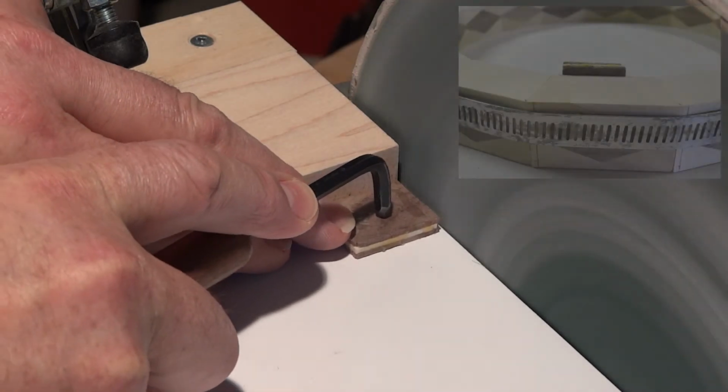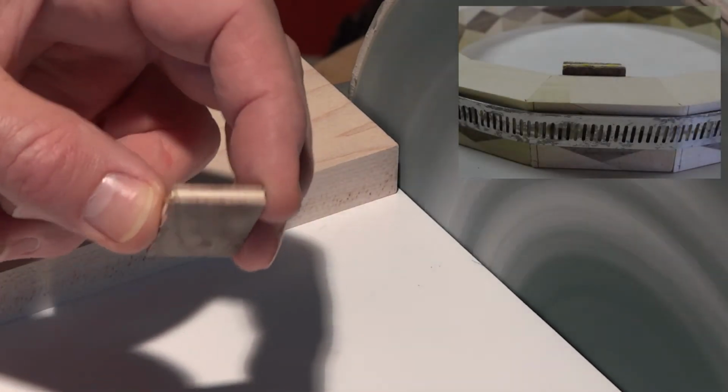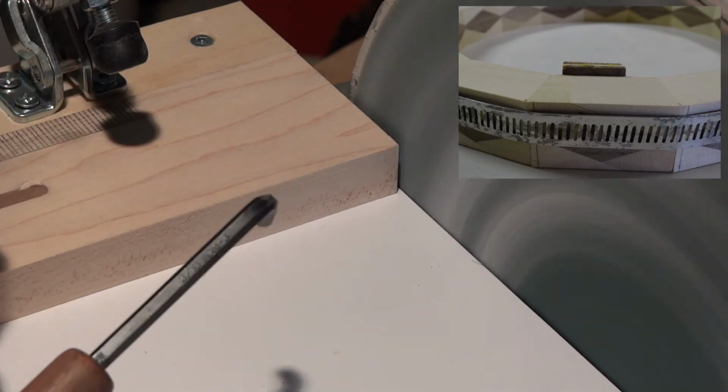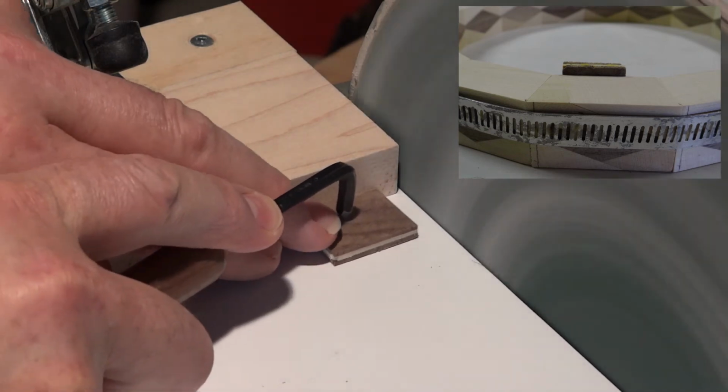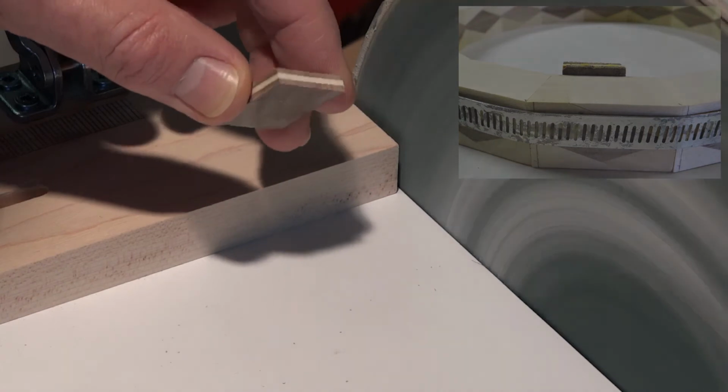When the glue dried, the dividers were taller than the height of the ring, so I was able to true up one end on the disc sander. This will ensure that when I glue the ring together, this sanded end will be ready. I may have to do a very light sanding with the drum sander, but I like knowing that it won't be because the dividers are jagged.